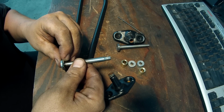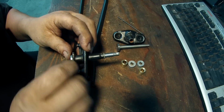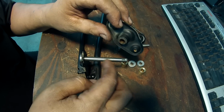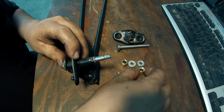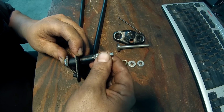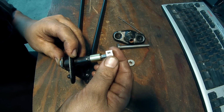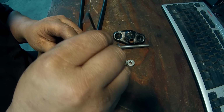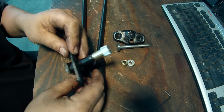All right, so you just take one of these. Once this is welded on, of course, that slides down, and there's little bushings inside these right here. So I'll put some grease on this after it's welded, and you slide it down, and then you take the little bushing, put the counterbore side down so that it'll fit over it, kind of like a little hat, like that, and then the new spline bushing goes on there like so, and then tighten the set screw, and that's it.